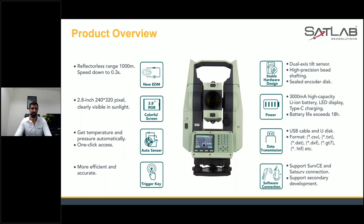With this resolution, you can clearly see what you are doing on your total station. We also have a new feature where the instrument can get temperature and pressure automatically. This is really good because pressure and temperature affect the accuracy of your total station. Wherever you're working, you just need to put in the temperature and it will recalculate everything — the PPM and the pressure — by itself. It's like a one-click access.